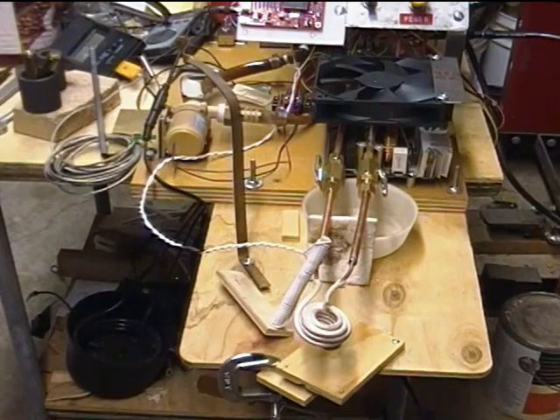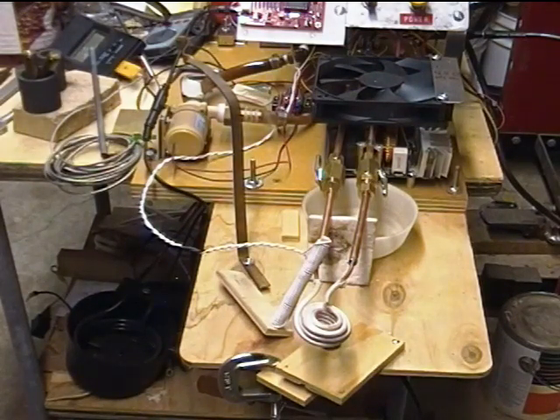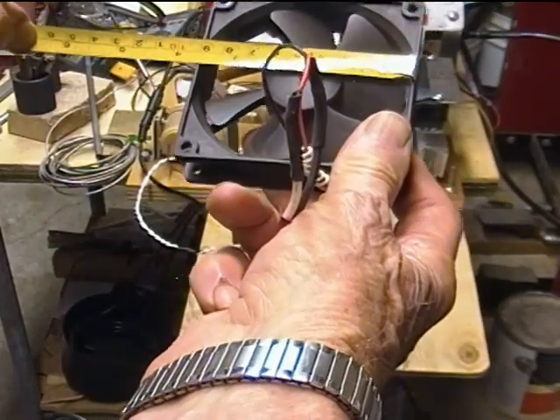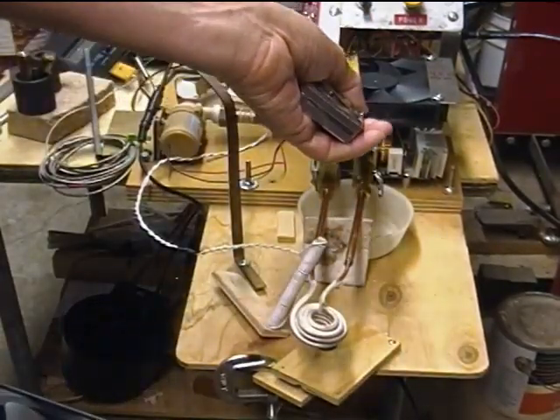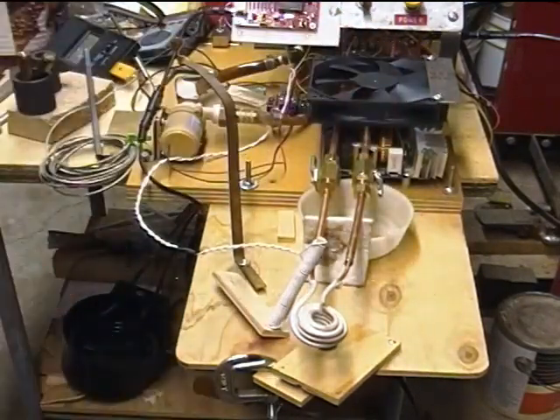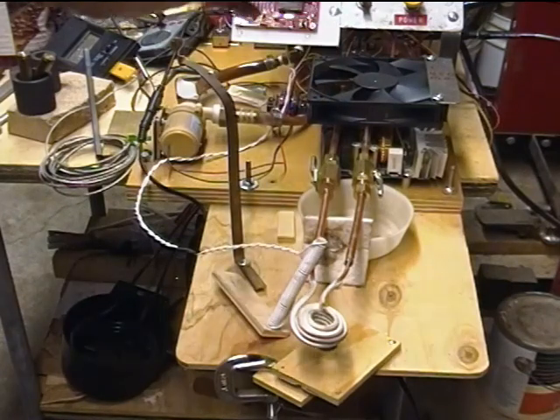I'd like to cover a couple of miscellaneous topics. The first one is the fan here that's cooling the circuit board. I recently upgraded from a 90mm fan to a 120mm fan to give a little additional cooling to the circuit board. Things were working fine and I hadn't blown any components in a long time, but I could feel that things did get somewhat hot. After I got the 1800 and 2500-watt units, I realized they had bigger fans. The first fan on this 1000-watt heater is about 3 and 5/8 inches square; I went to this 120mm fan, which is about 4 and 5/8 square. If you're setting one up and thinking about putting a fan, you might consider the 120mm size — they don't cost that much more.